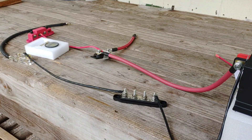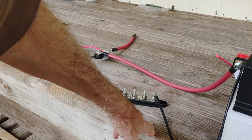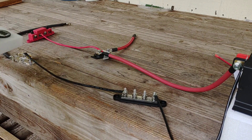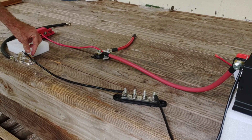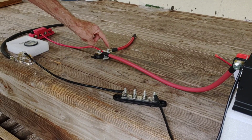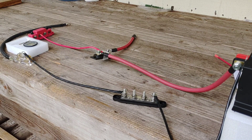I don't know the answer to that, which is one of the reasons I wanted to get this video out before I hook everything up. I should get my cables within about a day, so I'm getting really close to tying this whole thing together and firing it up. For the battery monitor, there's a 14-gauge wire I'm going to use — it doesn't come with one — to tie the shunt into the display. Then I'll pull the positive 14-gauge wire and tie it over to this side of the fuse. I think that's going to work just right.